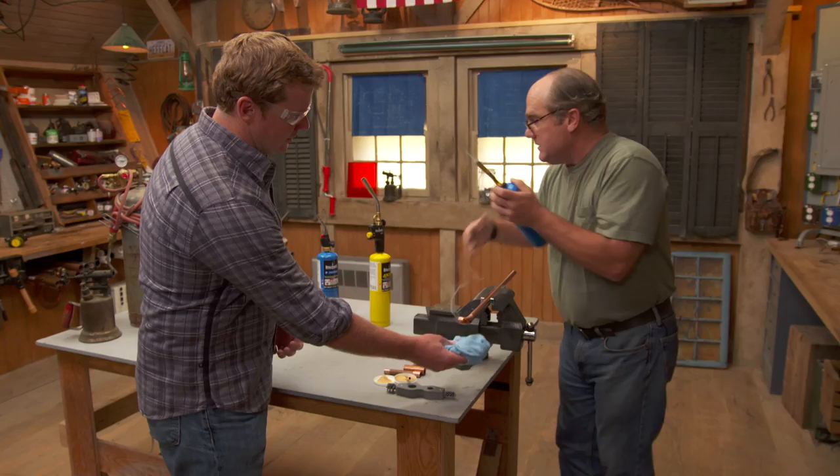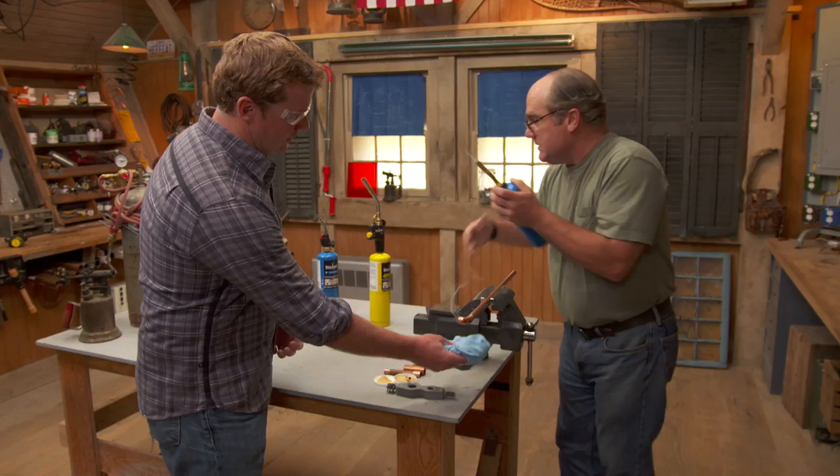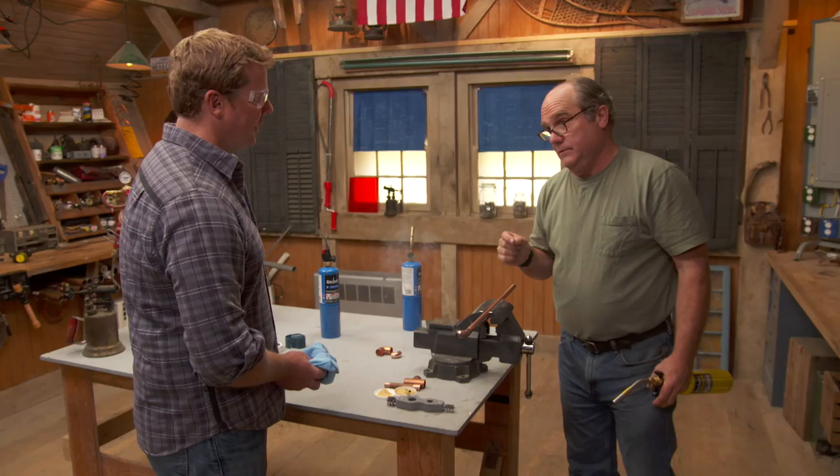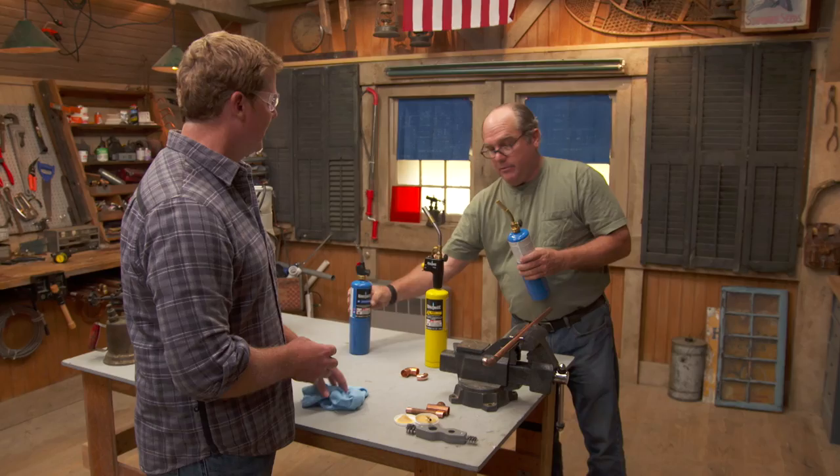The difference is if you use too hot of a flame, it would actually get so hot that all the solder could drip right out of the fitting. So too hot is not good either. We need to be using the right tools, the right gas, and working with the right technique. For basic half-inch copper pipes, these tips are fine, but as you get into bigger ones you want more power. Also, the melting point of the new lead-free solders is hotter, so you need the hot flame.